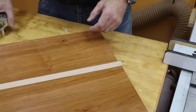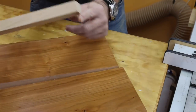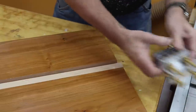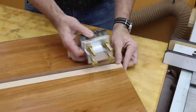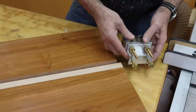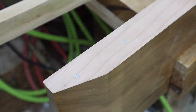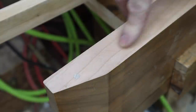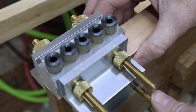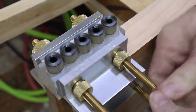By design the biscuit gives you a little bit of adjustment wiggle room, but this dowel does not have that — it forces it in. And that's why I cut this end on this board: the dowel jig also indexes off the end, so I'll be starting at one end, drilling holes, and working my way along the board putting holes every few inches. No surprise, I used dowels when I built the thing in the first place for aligning that maple strip that we cut out, so there are remains of the old dowels buried in the table.